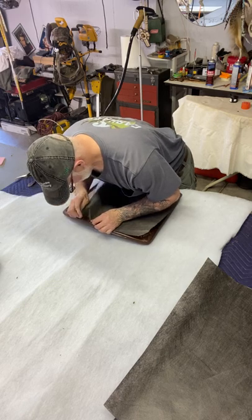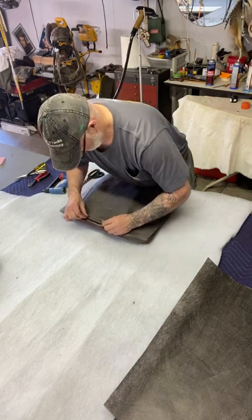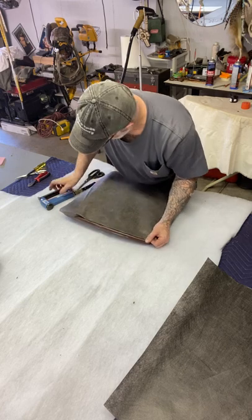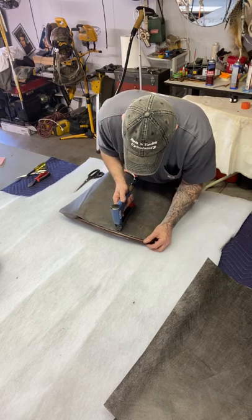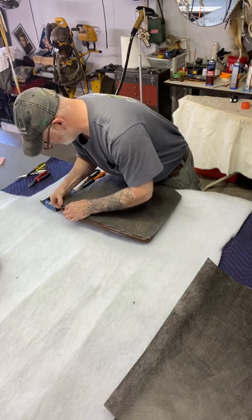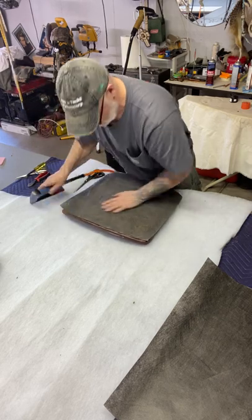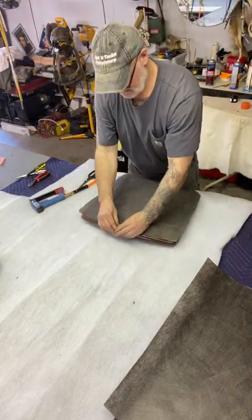It is key. The bottom of your chair is as important as the top. Be advised. So, you center your piece, you come up, one wide, come down. Bend your piece half inch in. You don't want to see it from the outside of the chair. About every 2 inches before you do your side. Boom, boom. Stop about 2 inches from the outside edge. Make sure you're a half inch in so you can't see it from the outside. Boom, 2 inches in. One, two, boom. Okay, you got that? See how that looks? Don't look like anything because you can't see it.